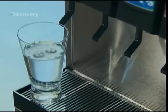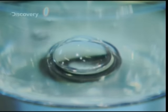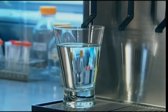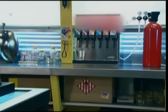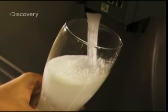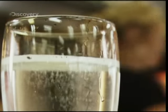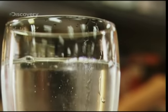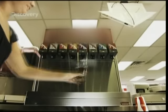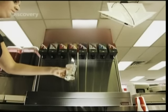The impossible mixture doesn't last. The CO2 molecules reattach to become gas once again, and that gas leaves the water in the form of bubbles. The bubbles in a soft drink glass are no more and no less than CO2 that was trapped in liquid form, which can now escape by changing back to gas. One glass of soft drink contains one glass of water and the equivalent of five glasses of CO2 trapped in water. Once it leaves the tap, the gas starts slowly leaving the soft drink, bubble by bubble, until all that's left is water and sugar. The soda fountain makes each soft drink by forcibly combining CO2 and water — an impossible marriage, unless it happens under pressure.